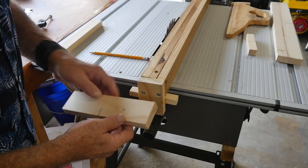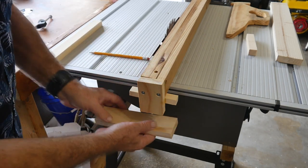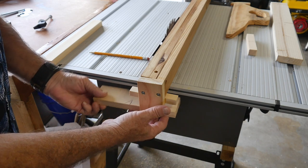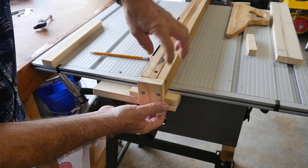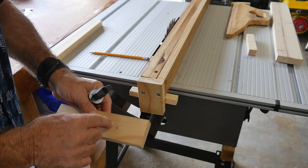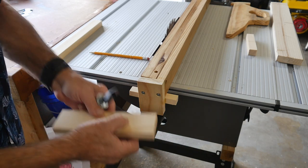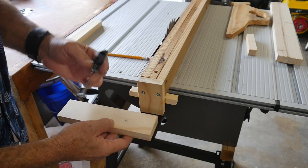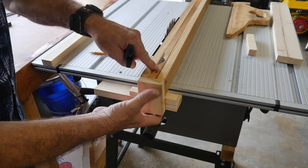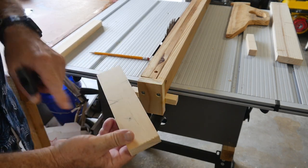This morning it's the next day — all the glue has hardened up. What I'm going to be doing is cutting this block and drilling a quarter-inch hole in here, then tightening this up so the carriage bolt will actually be driven into the wood and sucked up tight. I'll maybe even put a little glue on just to make sure the carriage bolt stays tight. This part will act as the clamp to lock this end of the fence.